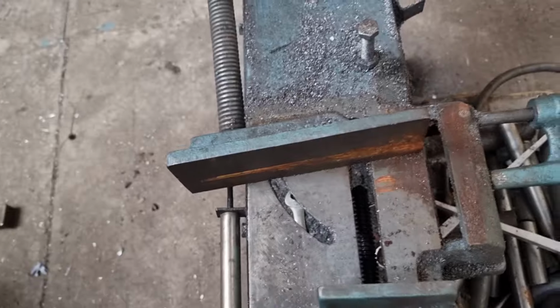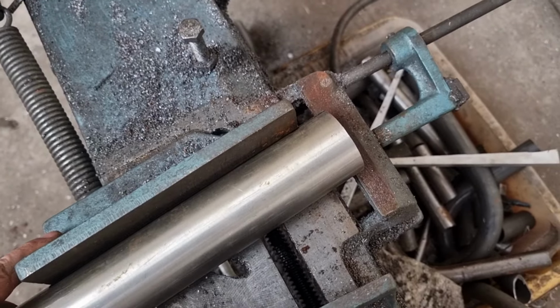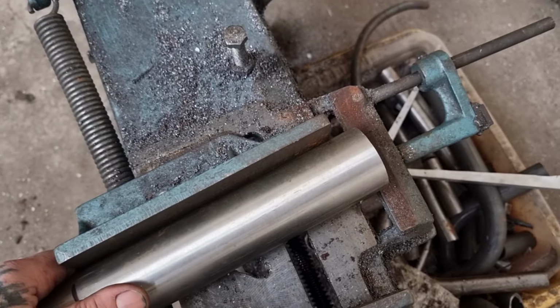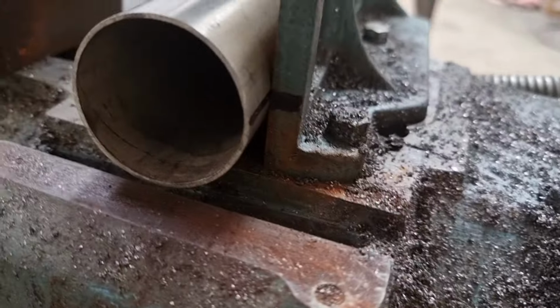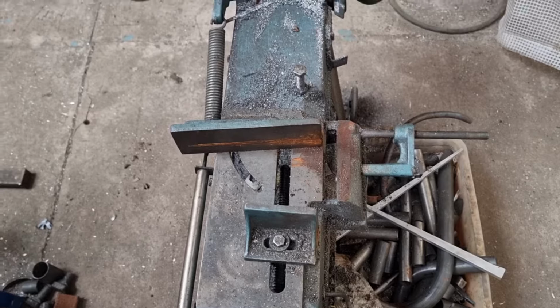And we've got this fence, or the vise, set at 4.5 degrees, which will give us a compound of 9 degrees when we cut it, which means 10 slices of pie will make a 90 degree bend. Yeah? So that's 4.5 degrees. When we cut it, it's got two of those angles on it. That makes 9 degrees, 10 makes 90. And what we need to do is line that pen mark up there. And then spin it round for the next cut and line that pen mark up, and that'll give us even, easy to index pies. I'll cut some and show you.